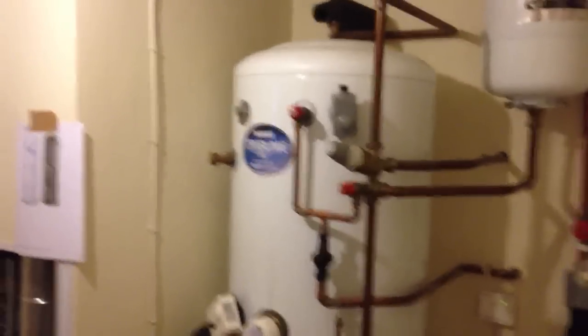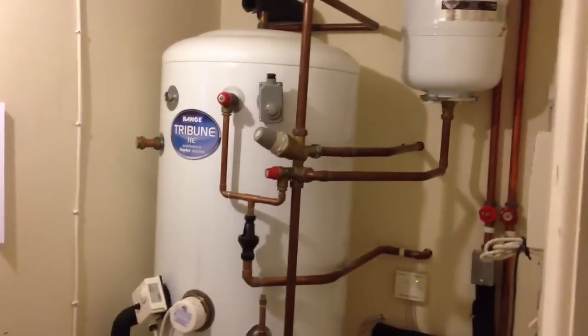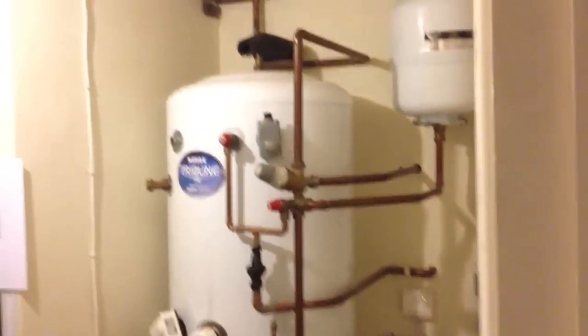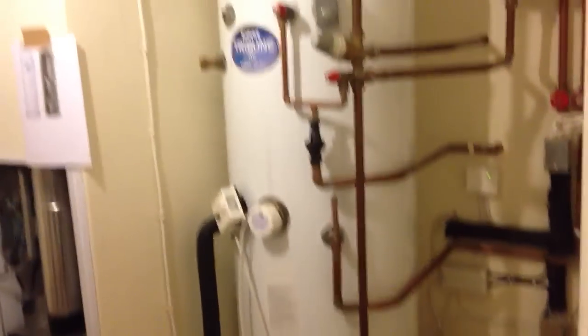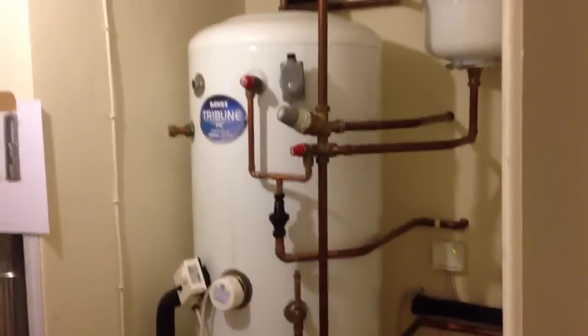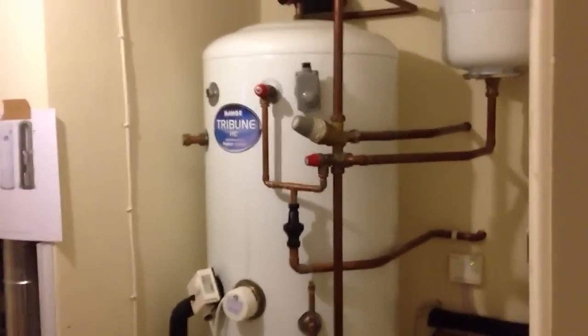So in summary, if you are considering replacing a boiler, or if you're looking to upgrade your hot water solution or system, I would recommend you get a solar coil cylinder in readiness for the solar thermal offering coming in the middle of the year. You don't need to get one this big. This thing's about 5 foot tall. Like I said, it's 250 litres. They come in smaller sizes as well, 160 litres. We're a 5-person family, so the idea is a big solution here for the hot water, heat it all up with a decent sized solar thermal solution, and then we can utilise all of that hot water for the bath, for the showers at night, and again the showers in the morning, before it then recharges through the day the next day.